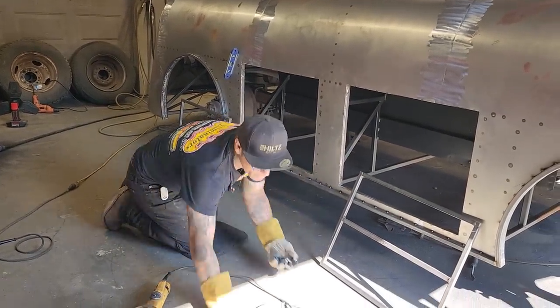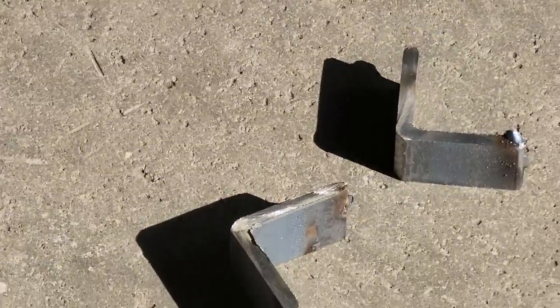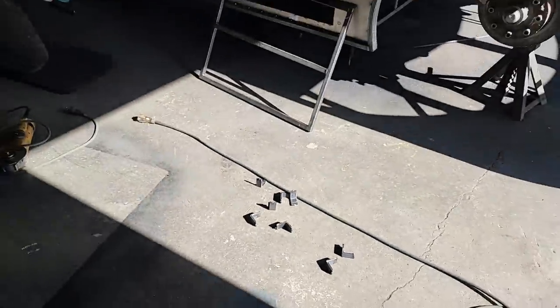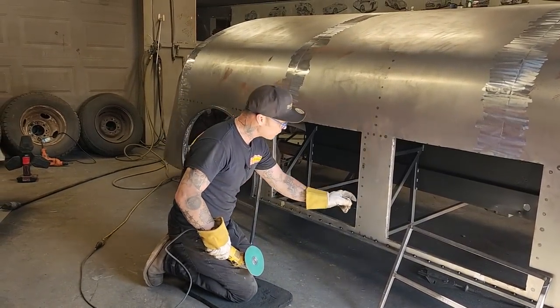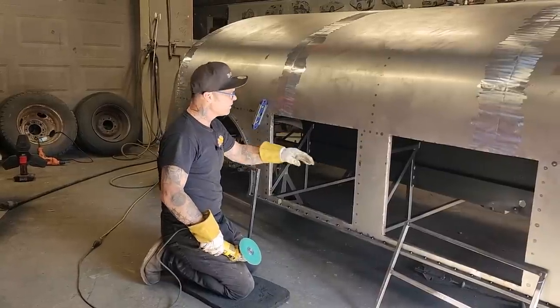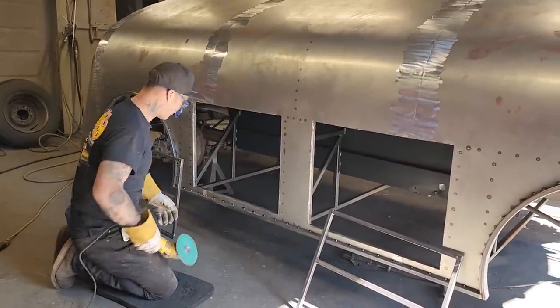And they're about a 3/16. That seems to be a fairly decent gap for something that you're making. If you make it smaller than that, you're playing for something hitting in the end. An eighth gap all the way around looks better when you're making it. But by the time you weld it, fill it, and paint it, you really haven't got much left, and then you're into more or less trouble.